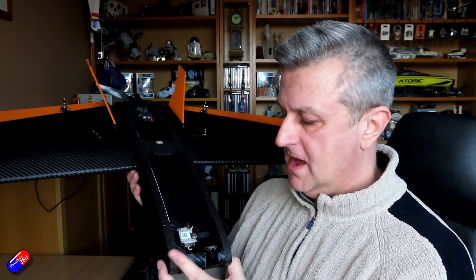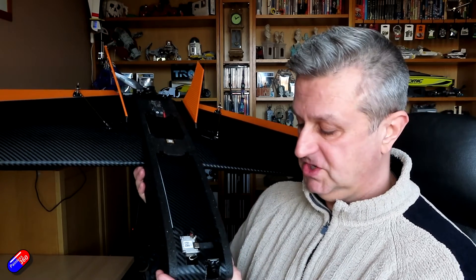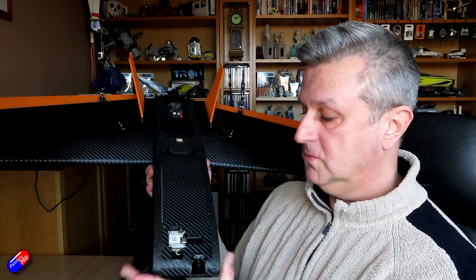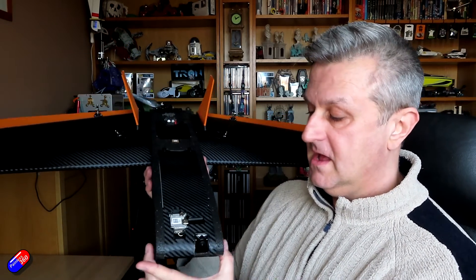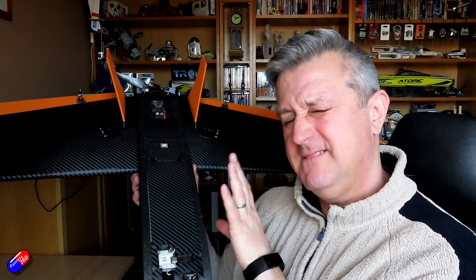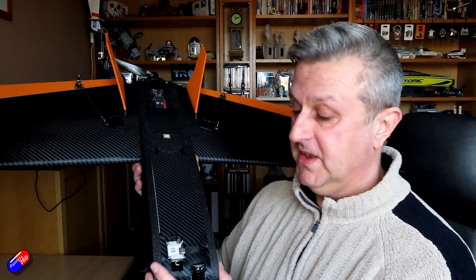Obviously I need to add the weight to the nose — I'll tell you exactly how much at the end. If you're using something like the larger battery you won't have the same issue I have. I'll probably cut slits in the side and sink the weight into the actual foam as well as putting it in here — it's better to add a small amount of weight at the maximum distance from the CG point rather than trying to put lots of weight closer in. I'm going to try and keep it as light as I possibly can, and in the next video I'll give you the all-up final weight with that weight in the nose to get the CG in the right place.